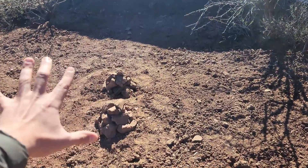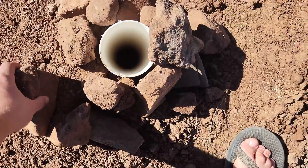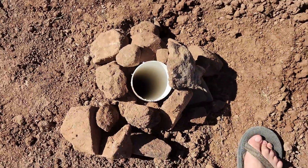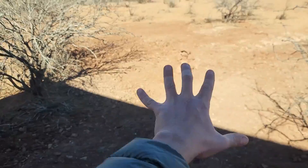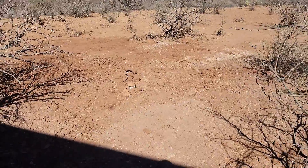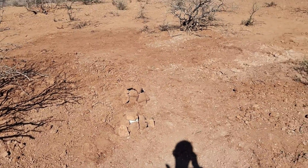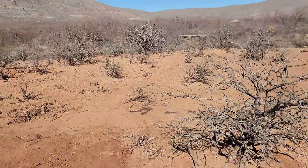We are wrapping up this build. This is the only evidence of our existing septic tank — these are our clean outs. I need to get one more lid for this one, and then just a little lid for the other. That'll let us vacuum stuff out if these ever get filled, but not terribly worried about that for a very, very long time. We specifically put the septic tank here — we could have put it closer, but didn't want that water near the foundation of the home. Also these trees and the mesquite tree over there will benefit greatly from this water. Within a monsoon season or two, this will all return back to desert. We are still looking at doing our little pond over here, but we have a lot of work to do before that point.